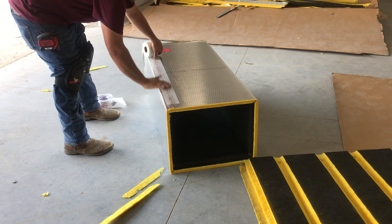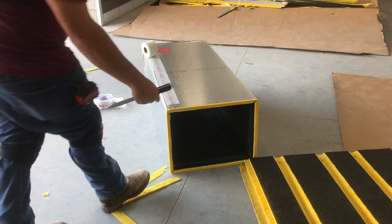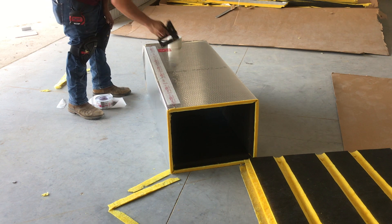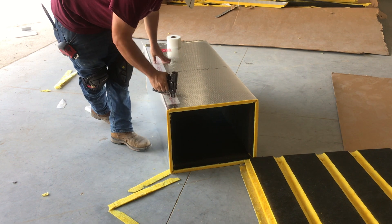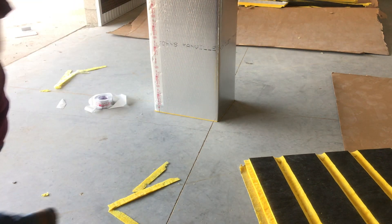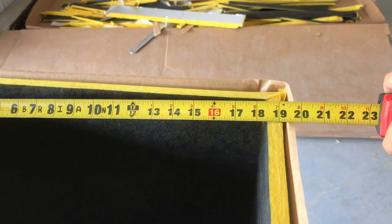Now we're going to go ahead and put the fab on. You do this after the foil tape, and then you're going to mastic it. We used 181 mastic. You just got to staple it on. Now it's ready for mastic, and that is a nice square duct. It's going to be 18.5 by 14 — right here you'll see 14, and right here you will see 18.5. On the money. Thanks for watching, we'll see you next time.